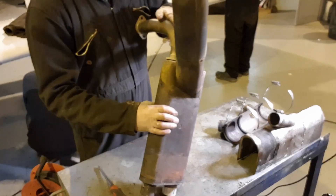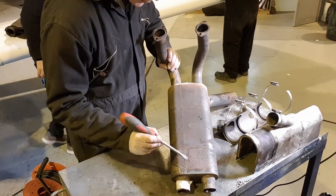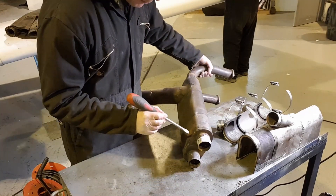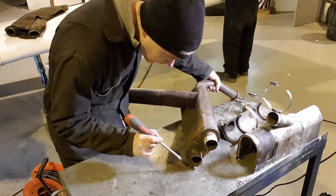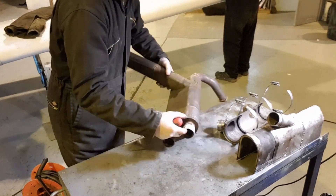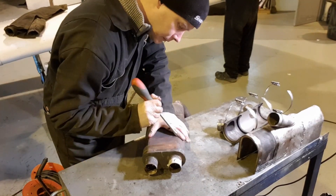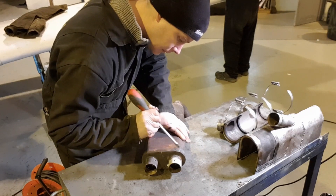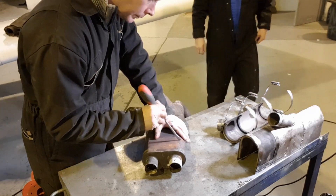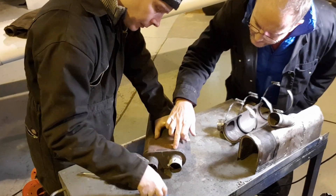Back to business — I'm going to have a look at the whole of this exhaust can because I'm pretty sure I found a perforation, but I want to make sure it's sound everywhere else as well. What I'm doing now with the screwdriver is what we call the tap test. You can often hear the tone difference — if there's an eroded part of material it will sound a lot duller. Yeah, there's my hole. I'm tapping up to it now — and Aiden was pretty quick to come over and have a look.